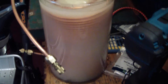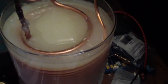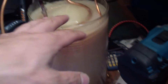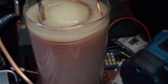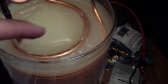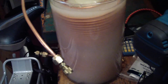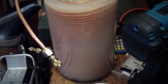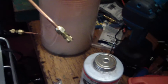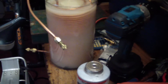One way to address that issue is to essentially bond the thermosiphon coil to the condenser coil, or get them really quite close to one another so there's good heat transfer and the thermosiphon starts to dissipate heat rapidly. I didn't do that here. I think the reason was I was a little hurried, the diameter of the inner thermosiphon coil was already set from a previous experiment, and there was a lack of forms to wrap the two of them together. But I learned a lot from it — and now I've got six pounds of Vaseline sitting around, so you can care for a lot of cold sores with that, or have a big party.